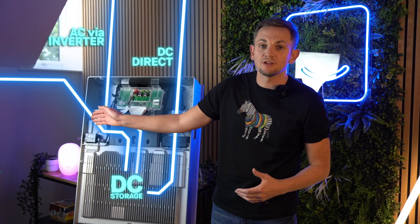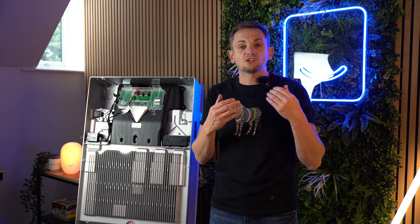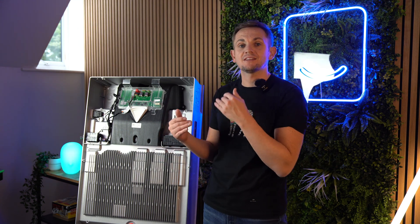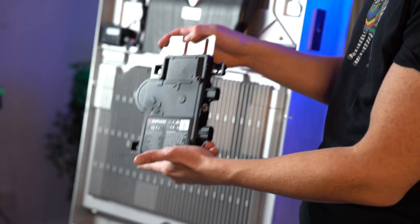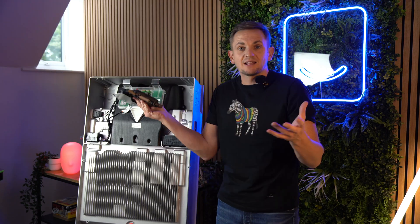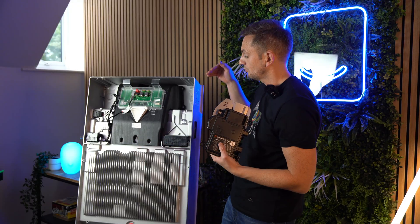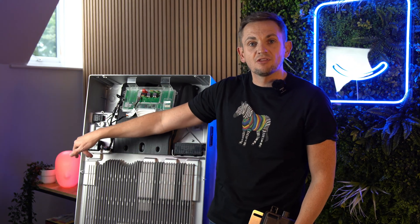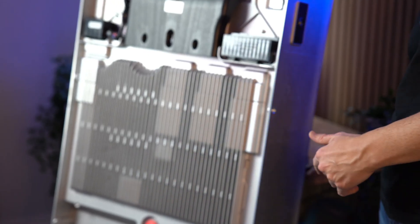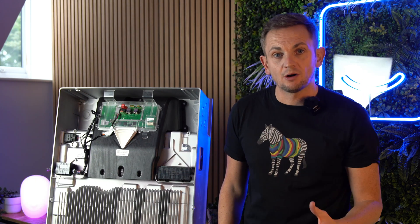This AC coupled side is on the left. AC coupling means you don't wire the DC solar panels straight into the Powerwall — you're converting that energy elsewhere. You can do that via a micro inverter system on your roof, where DC is converted locally so AC comes off the roof. We can't wire AC into a DC connector, so we wire it on the AC side of the Powerwall. Likewise, if you've got a string inverter, you can use its AC output to connect to the Powerwall.